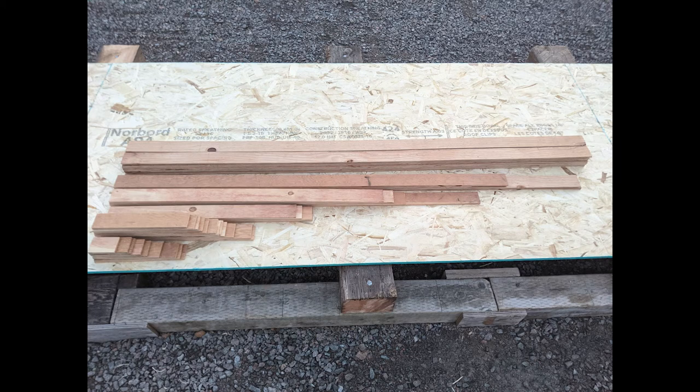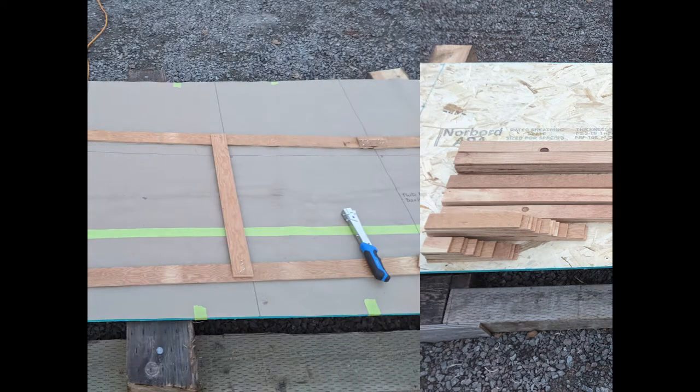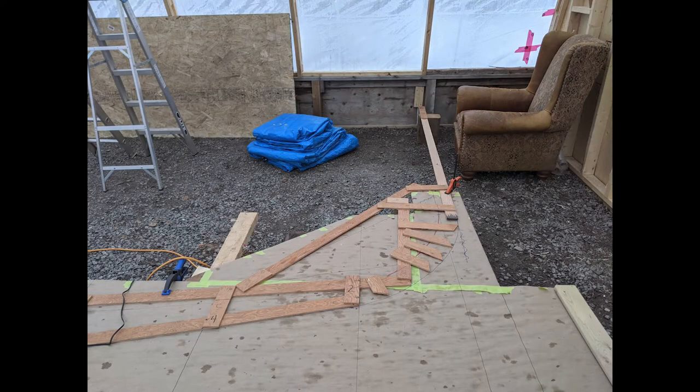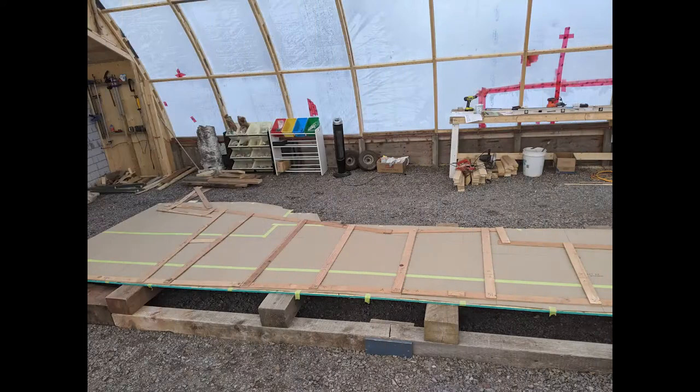In this video, plywood strips are measured, cut, glued, and stapled to create a full-scale pattern of the keel structure from stem to stern, and onto which the station marks and the rabbet line are transferred from the paper pattern.